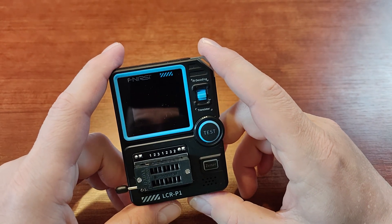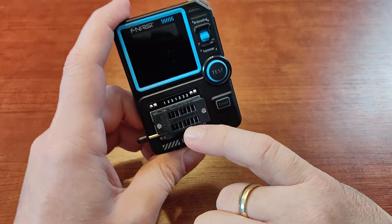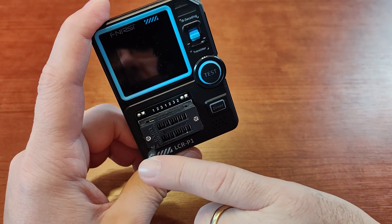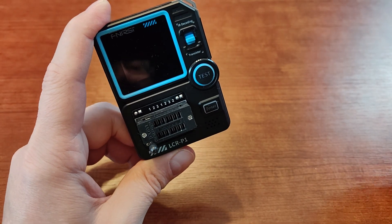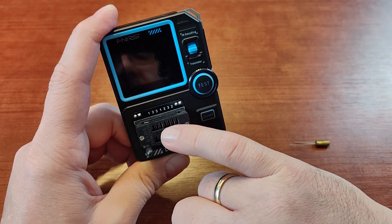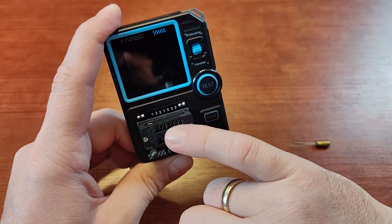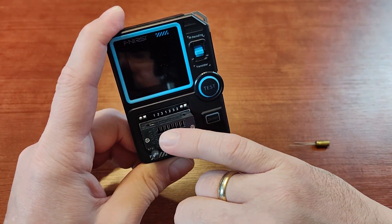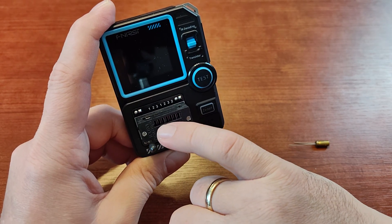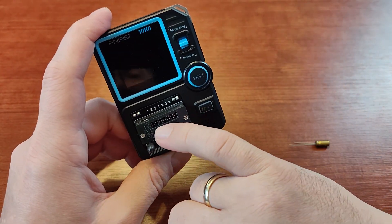I'm using this one mostly to test transistors and SMD components. How does it work? You need to use the set of connectors numbered 1 to 3. For 2-legged components like capacitors or resistors, you'll use 2 connectors with different combinations — meaning 1 and 2, 1 and 3, or 3 and 2. You cannot use 1 and 1 obviously. For 3-legged components you will use 1, 2, and 3. It doesn't have to be the first set of connectors — you can use any combination, which gives you some flexibility for larger components.